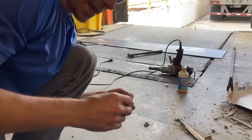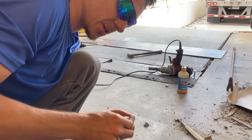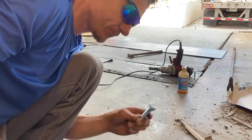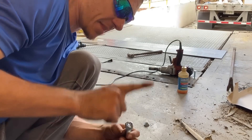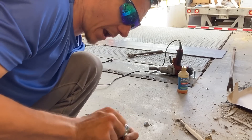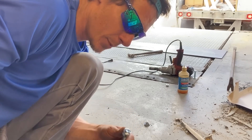Whenever I do redheads, I like to thread it until it's almost all the way threaded — until the nut is just still above the stud itself — and then I like to hammer on that. That gives me more hammering surface rather than just hammering on the tip and possibly damaging the thread, and lets me be a little bit more precise.